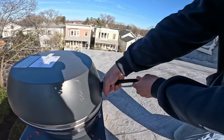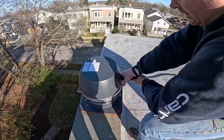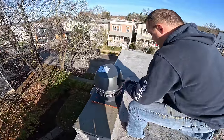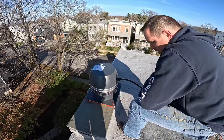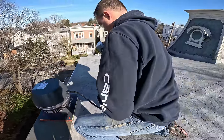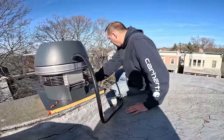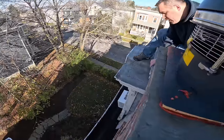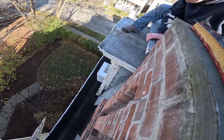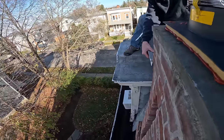That's a 1/5 horsepower, 2.7 amp fan, which might not allow us to use the 1.5 amp remote fan switch I had hoped to use, but we'll find another solution. As long as we can get in this attic, we should be able to get wire to a switch out of our junction box. Can we go with a piece of UF or something? And maybe, just maybe, we can get into the attic somehow.